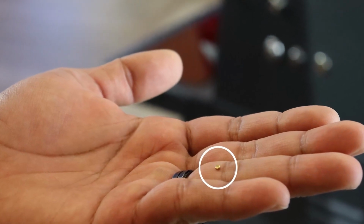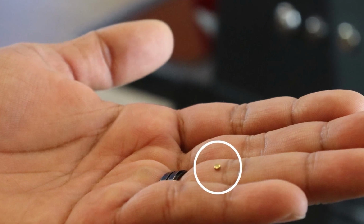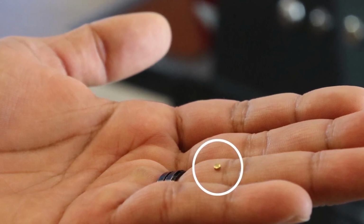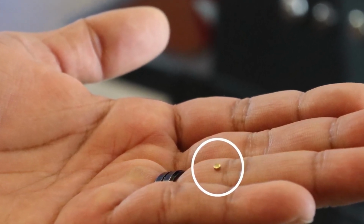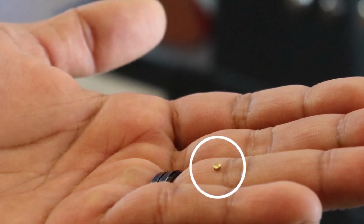After the wafer has been removed, never reinsert the change key again, as this will cause the key to get stuck on the lock. If the lock has a left-handed rotation or it does not rotate a full 90 degrees, I recommend pulling out the core and performing this step while holding the core in your hand.